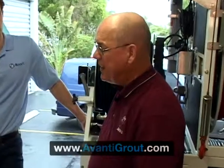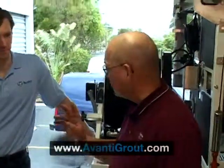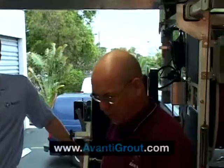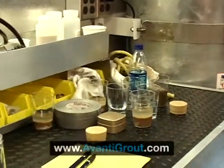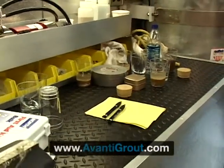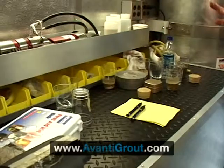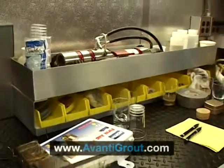The heat is nice because, at least where we come from in Wisconsin, the water can be cold year-round. We like to stabilize the water temperature about the same temperature as the sewer line — 60, 70 degrees. It makes the grout perform predictably. This is a workbench. It may not look very important, but to an operator at night, he often has to repair some of his equipment. It has a vise, storage area, a lot of storage above, and a toolbox on this side.